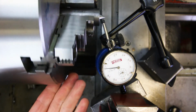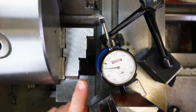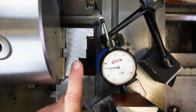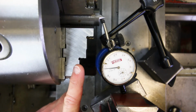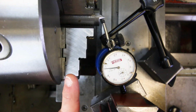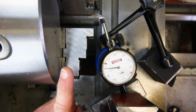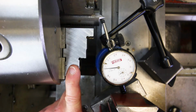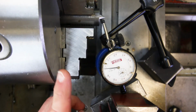Okay, so that's all you got to do. It's a good lesson that you can always true up a surface just by taking a cut on it in the spindle, right? Then it will run true to the spindle axis. But if you just put it in, especially into a 3-jaw chuck, which doesn't repeat perfectly, then it will not run true, right? And then all of that error, all of that runout is going to transfer to the part, okay? In terms of the misalignment of the features, that's not good. It's not what we want.